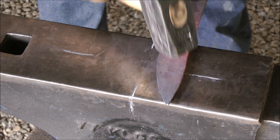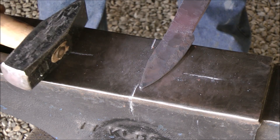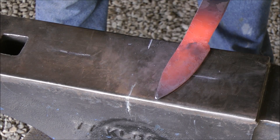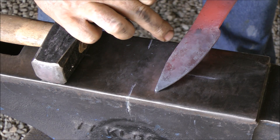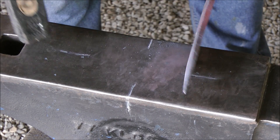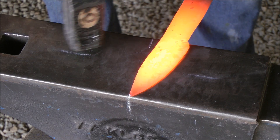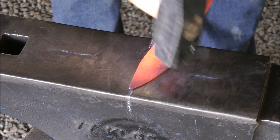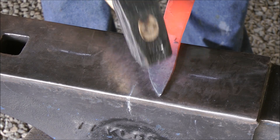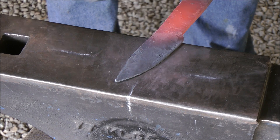Coming back into the center of my blade, still working up the center with more controlled hammer blows. What I'm going to do is create a flat surface from the edge to the spine, focusing my blows on both sides. I've got black metal so it's back into the forge. Still working that spine, making sure that everything is nice and flat, using small light hammer blows. You can see what I'm trying to do here is get rid of all the little forging marks in my steel.